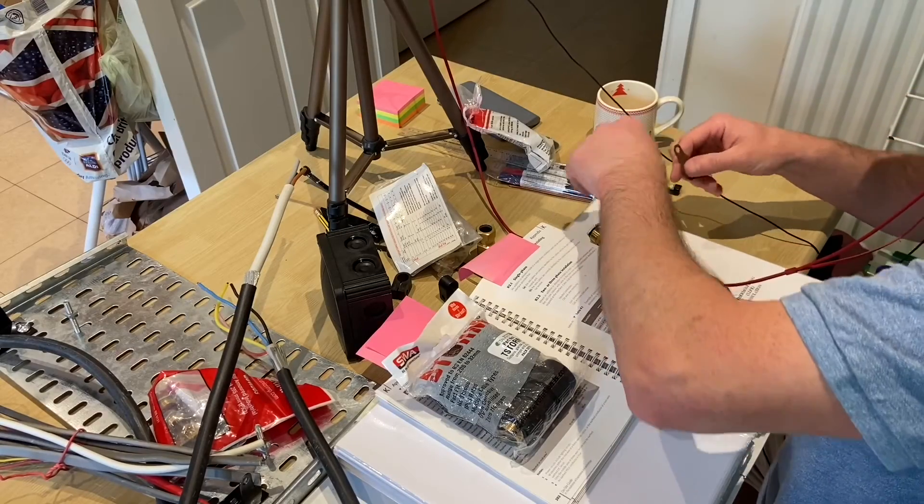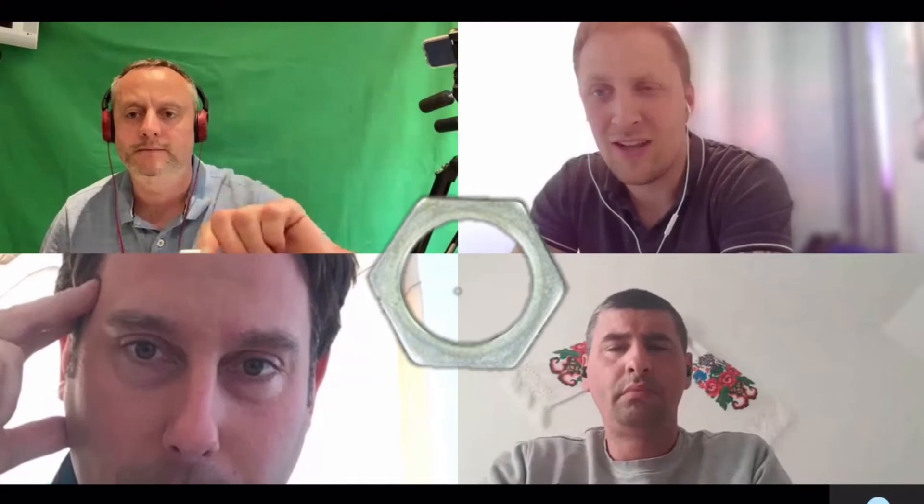I've opened up a BW20S gland pack. John, can you remember what that is? An earthing ring — everyone else, is this a musical instrument? No — it's often called on site 'the banjo,' but for our exams and my notes this is the earthing ring. We make a connection to the metallic or plastic enclosure depending on what we're doing, and then we drag the CPC through from the armoring of the gland. What's that next piece? It's a locking nut — a 20mm locking nut.